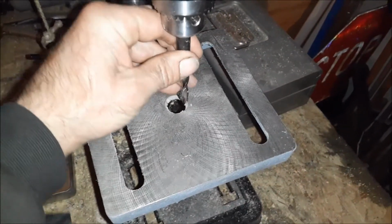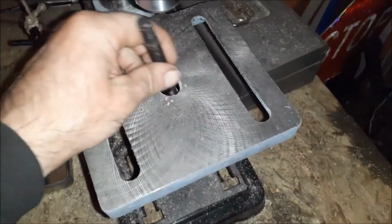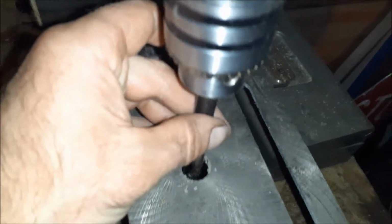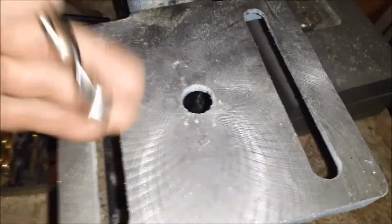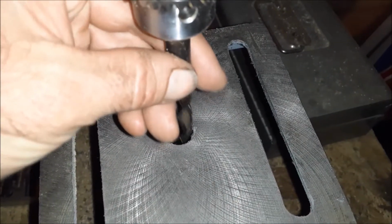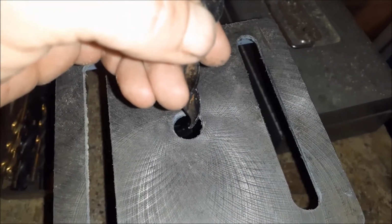Okay, one little trick here. I'm just switching up to a bigger bit. When you go to put your bit in, keep the deck of your drill press a little high, and that way you can stick the bit through the hole and make sure it's going to line up with your hole. Okay, let's get that going the right way. Okay, so we got that open now, chuck open. You want to make sure it lines up with your hole, because otherwise if you go through the material you're drilling and start drilling into your deck, you will drill through it. It's not the end of the world, but the more you do that, you're going to wreck your deck. So we don't want to wreck our decks, so let's keep it centered. The good way to do that is just do the up and down test. It's easier to do when you're not holding the camera, but once I tighten up the chuck there, I'll drop the deck a little bit, and then I can put my piece in there and drill through.